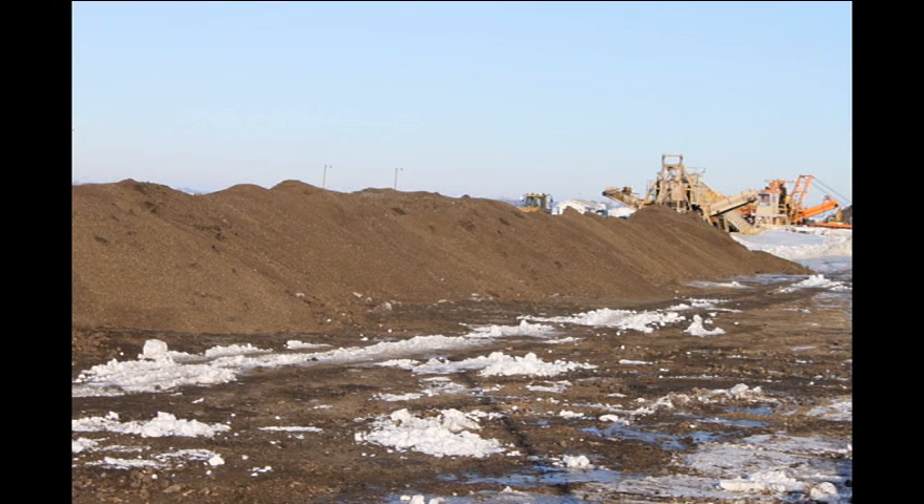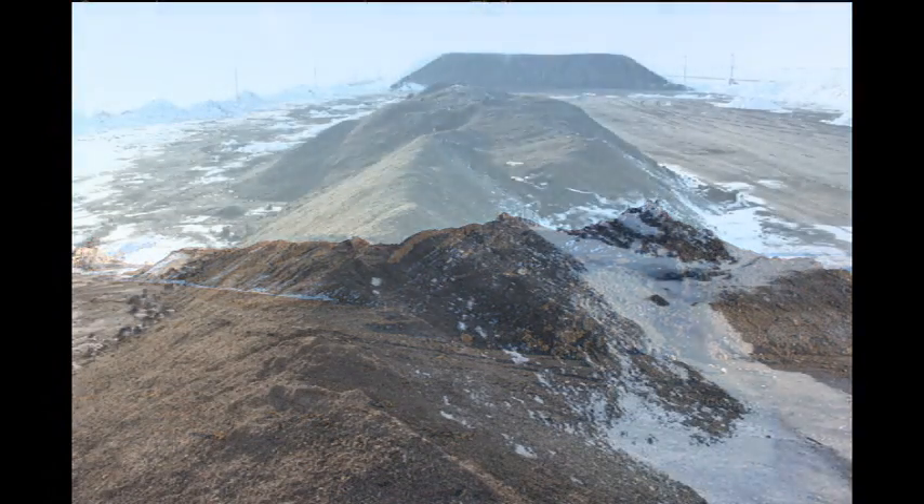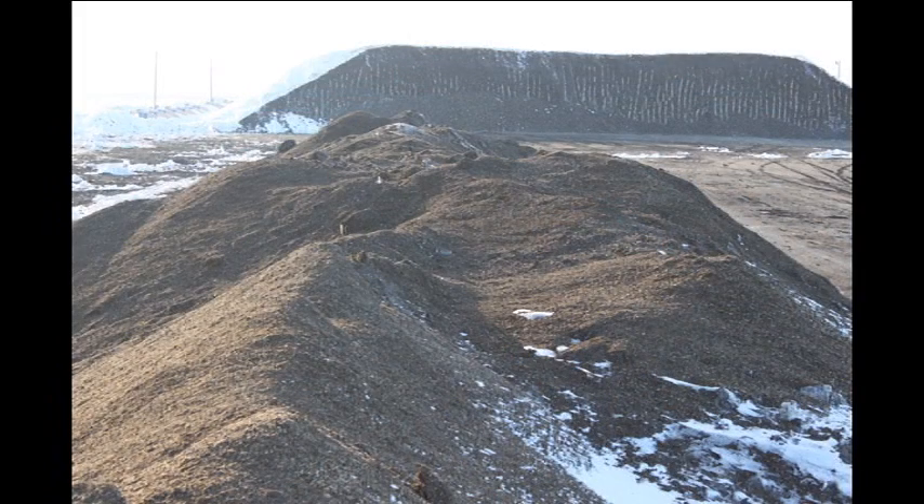The re-screener has major advantages to its use. In some cases, the trucking company must haul the beets 90 miles one way. With all the snow, dirt, and other debris left behind at the site, it saves many trips over the course of an entire beet pile. With all of this debris being left behind and not run through the plant, the sugar company could potentially save millions of dollars in avoided EPA issues, reduced lime usage and processing, mud buildup in the ponds, and increased plant efficiency.